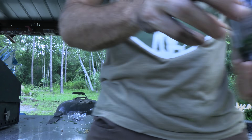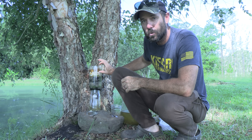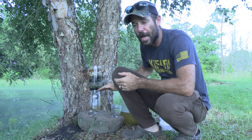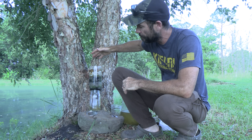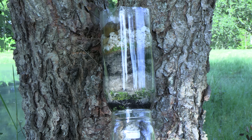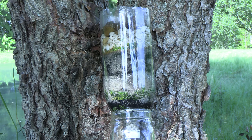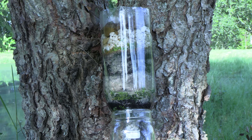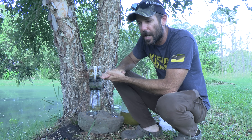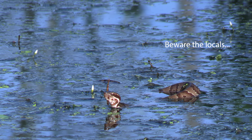The filter has multiple layers. Up at the top, we've got pretty coarse rocks, and directly underneath, a layer of pea gravel. These two layers aren't really doing much filtration — their primary function is to protect everything below from the disturbing action of the water as you pour it in. Below the pea gravel, there's a layer of sand and charcoal dust — this is the layer actually doing all the filtering. I've used finely chopped cedar boughs as a sieve to keep those layers separated. Down at the bottom, another layer of cedar boughs keeps sand from sifting into the granulated charcoal below it, with a little pea gravel at the very bottom to help open things up for better flow.